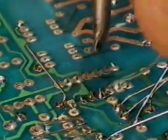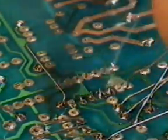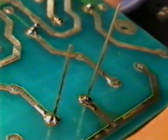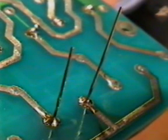As you will see, the whole operation only takes a few seconds. You will soon get a feel for how much solder to use. Inspect each joint thoroughly to make sure the solder has flowed right around the joint and has formed a shiny little fillet of solder like this around the wire. This is a good solid joint.